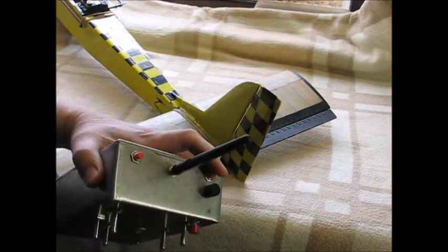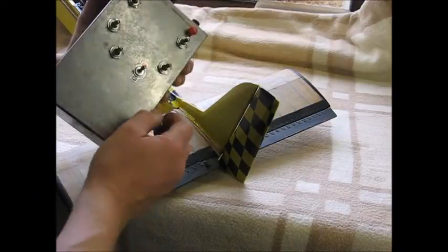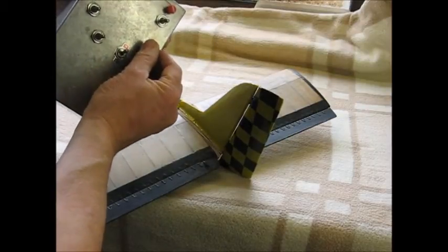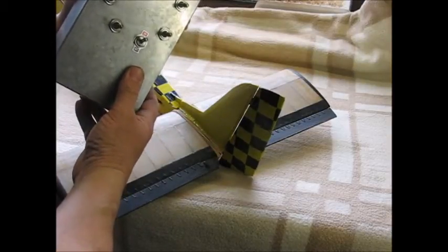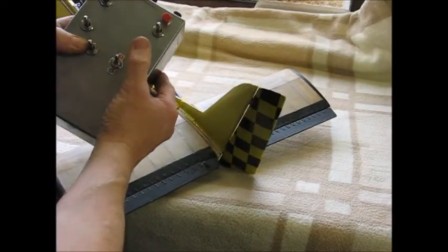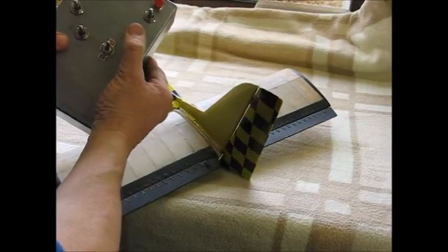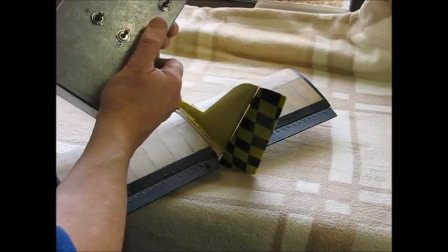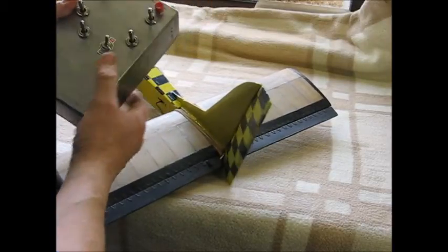This button is rates. Say that's too much rudder movement — what I can do is press rates. It says R for rates. I can now move the rudder to the maximum movement I want. Let go — it says V, which is the end of ATV, and now that's the amount of movement we've got. So that's not enough movement. Let go of the ATV button. And that works on every channel.